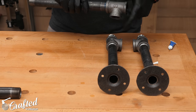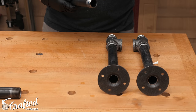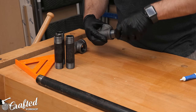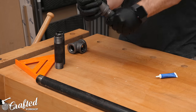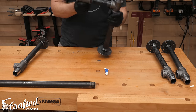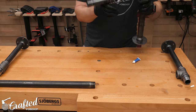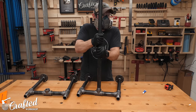I used threadlocker to lock all the joints together and added a few drops onto the threads at each connection point. Once one section was together, I made sure to check its measurements against one of the other sections to make sure they lined up. Next, I repeated the process for the short stretcher sections that connect the legs and long stretchers. And if you've got a vice on your workbench, it can definitely be really helpful in getting these joints tight. I could then assemble each leg section, attaching a leg to each end of the short stretcher. I also needed to make sure those center T connections were perpendicular to the legs so that the long stretcher would line up properly. Finally, I could add the long stretcher to complete the base, and I made sure everything was nice and tight and checked all the measurements before moving on to paint.